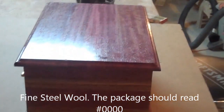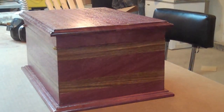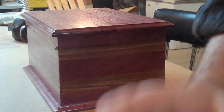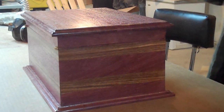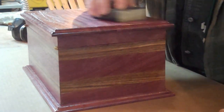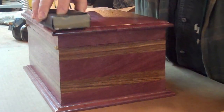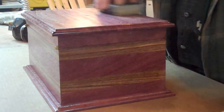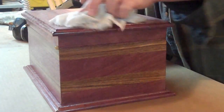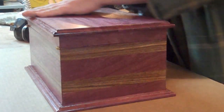What I'm going to do now is wet sand the top and see if I can get some of that unevenness out. This process is always scary to me. So I'm going to wet my sandpaper and just rub this back and forth. I'm not going to press too hard — I don't want to go through the coats of lacquer. I just want to knock down the surface, and this really should be all it takes. I'll use my rag to wipe off the excess, and now you can see it really does have a smoother feel to it.